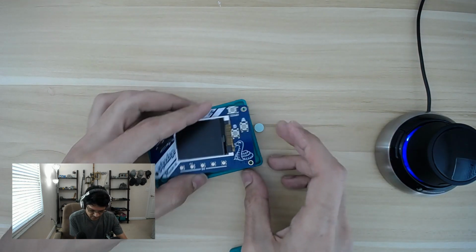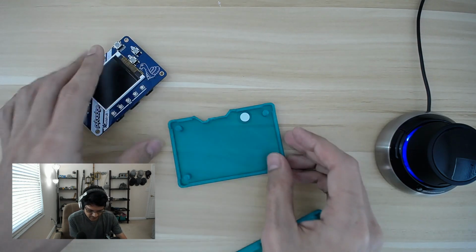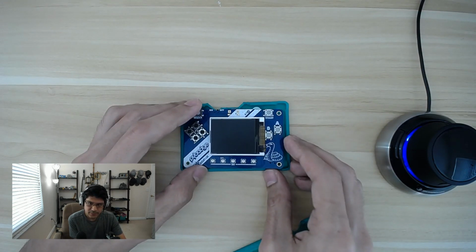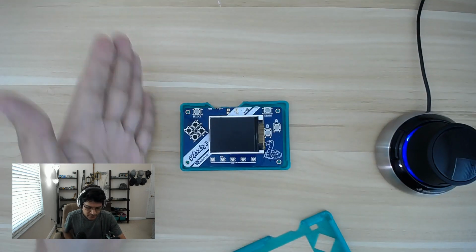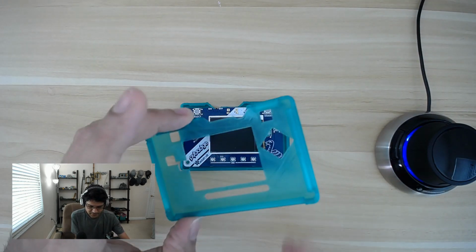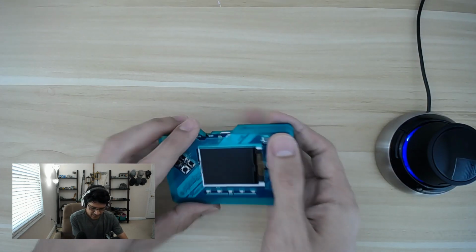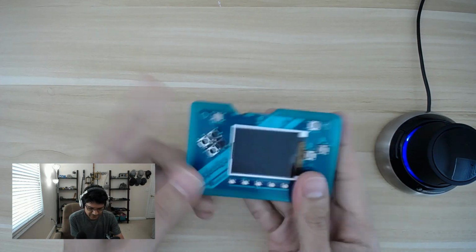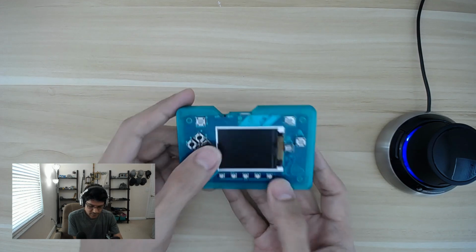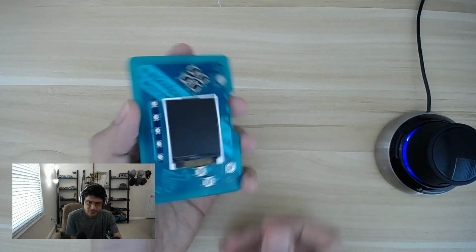Well, when you rest this on, let's put the reset button back. When you rest the PCB on top of the standoffs, there's a little bit of a leeway here for this thing to move around because there's clearance between the edge of the PCB and the edge of the case. That is for these snap fitted features. The cutouts are what keep the components locked in place. So once these snap fits are clamped down, there's nowhere for the PCB to go, because it's pretty much registered and locked in there with these cutouts. So that's the way that is working.